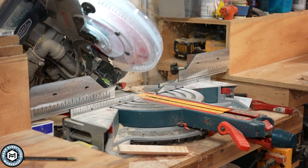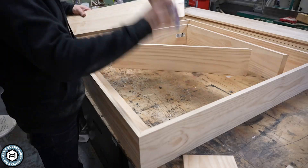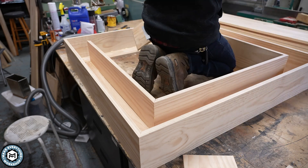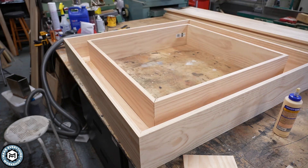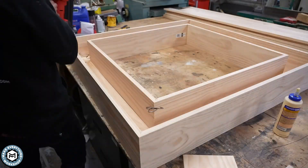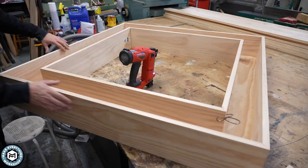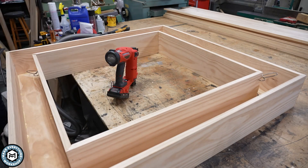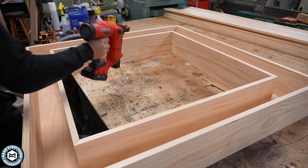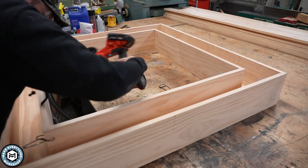Now I have to build the interior perimeter — the interior verticals — again over on the miter saw cutting a bevel. You have to watch your accuracy here; you really want to make sure your saw is cutting true and square. So if you have a crappier miter saw, you might want to really spend some time to tune it up. All I'm doing here is creating a nice tight wedge fit so I can put some glue on the outside corners and wedge everything in. Then I can get my nail gun in and those little pinching clamps to get the outside. I'll throw a link to these pinch clamps down in the description — these things are great. The only thing you have to worry about is if you're working on a finished piece, they do obviously leave an indent. And you kind of need a lot of them because if you're trying to get a lot of pressure on a corner, you're going to need two or three, meaning four to six holes you'll have to fill. What I'm doing here is essentially gluing and nailing from the inside, hitting the miter from the inside with the nail gun, and then hitting the inside edge with the nail gun as well by hanging it off my bench and making sure everything is nice and level.